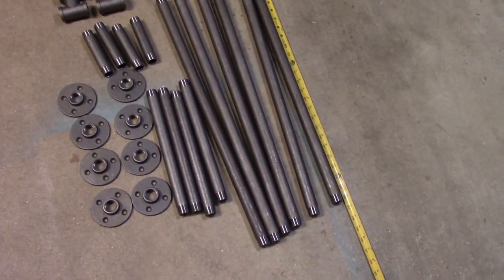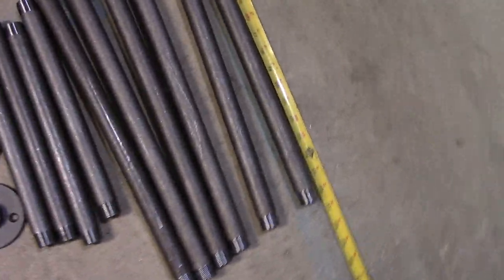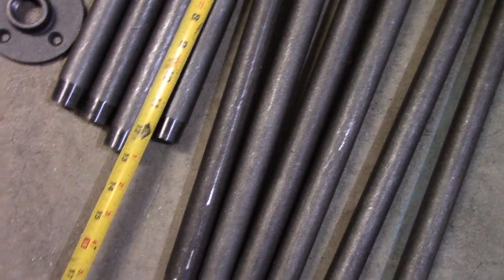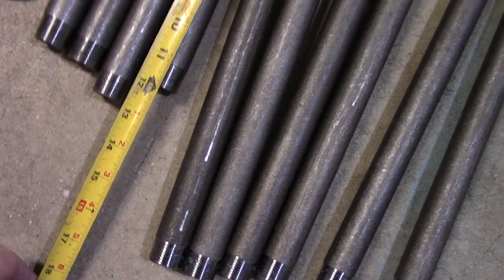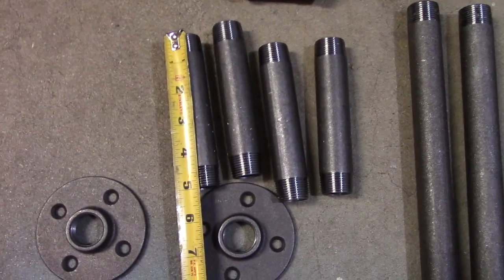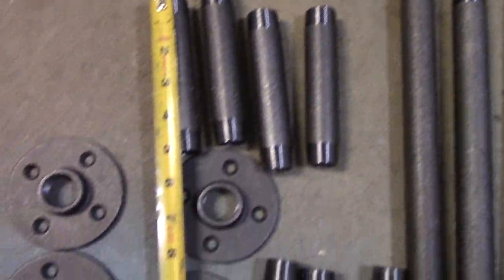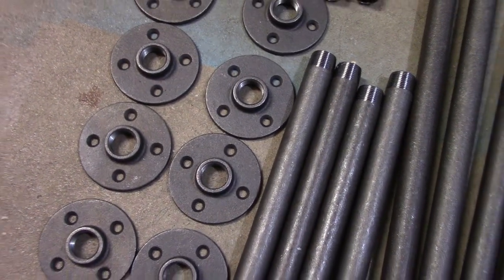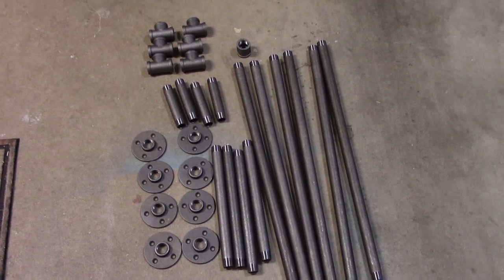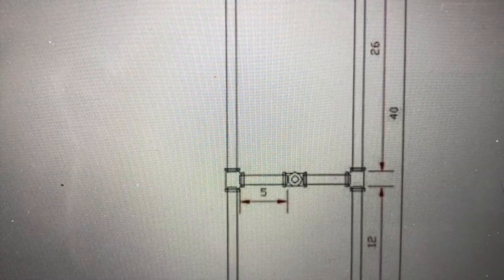Here is a picture of all the parts you're going to need to assemble the legs of the custom table. I will put the full list in the description below. This particular one uses three-quarter inch black pipe — these are the couplings, the T's, and one coupling. These are the floor flanges for leg support, plus the pipes. Here is a schematic of what it's going to look like when you start assembling everything — where the T's go, where the coupling goes, and the floor flanges.